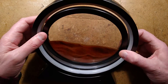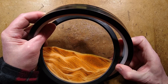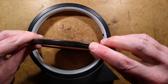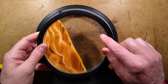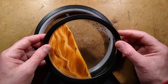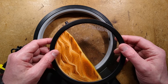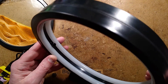I've noticed that if you turn this on its side and gently flex the frame out - I don't know if this is standard procedure - but this must be how they get it in. You can actually take the glass picture frame out, revealing a small hole in the top. That hole is for adjusting the liquid and water inside, because normally these come with a syringe with a sharp pointy hypodermic needle. You can use it to inject a bit more water or air, or remove some. Unfortunately, because this is Britain and it's the nanny state, they have removed the syringe from the packaging.